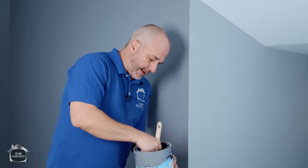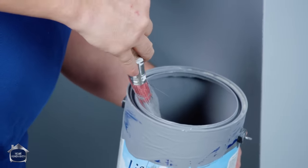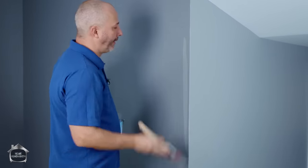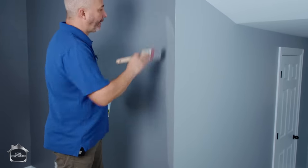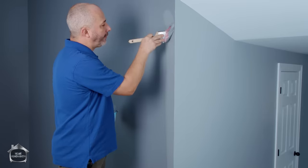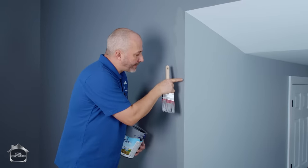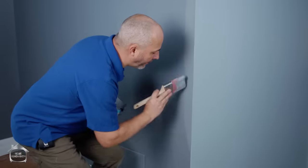Generally speaking when we're doing this work we use the same can of paint with two inches of paint in there, and I just push my brush right into the paint and I'm filling the inside of the brush. Now what we do is we're gonna lightly just put a little bit of paint on that corner, and then I'm gonna run the brush right to the edge but not over the edge. That is called cutting the corner. The nicer your drywall work and the nicer the corners are, the better this shows. If you want to get rid of the brush lines you can run your brush over and over again, or you can also go and get a little mini roller and just texture this wall after you're done, but stay a quarter inch away from the edge — less is more in this situation.